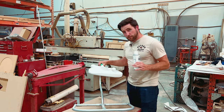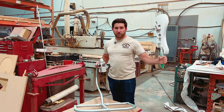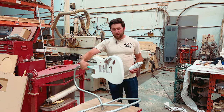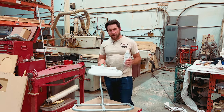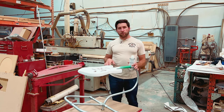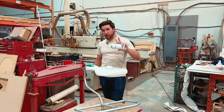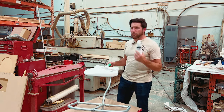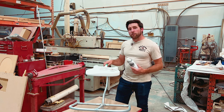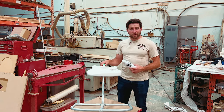I'd be remiss if I didn't mention the spin twist spray rig that this is hooked up to — you can get a drying rack for it too. This thing makes spray painting much easier. If you're only doing one guitar, maybe it's not worth it, but for me who does quite a few, it's 100% worthwhile. I did have my own homemade version before, which I've basically thrown in the garbage because this works so much better. I'm going to move over to the booth — I don't want to spray lacquer all over the place in here. Get my mask on, get this shaken up. We're going to put two coats; we won't wait very long in between because nitrocellulose lacquer dries to the touch very quickly and it's quite warm in here.